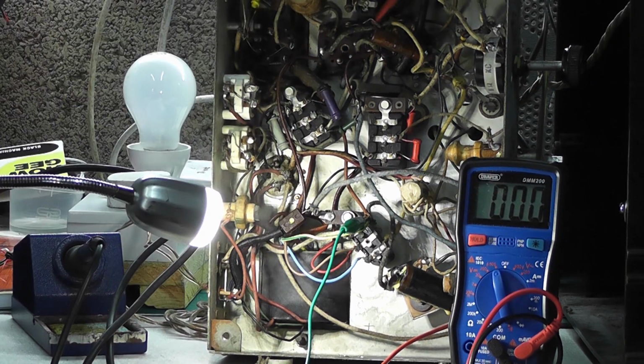And as I suspected, it's that capacitor which is boiling. And I think you can see it boiling now. Wow. And I knew there was something wrong there because I could actually see the HT voltage dropping right off. On full volts, it started to go. So it was a good job that I initially went onto half voltage. Anyway, you actually witnessed the first smoke from this Philco radio.